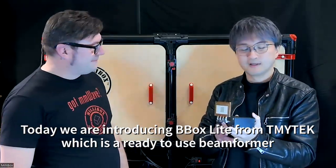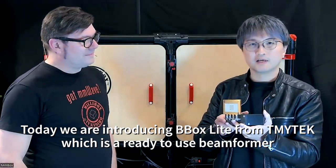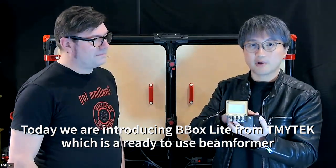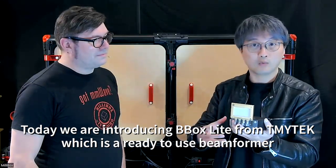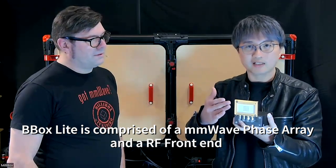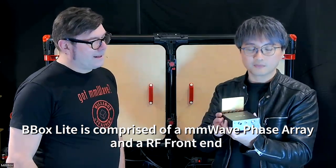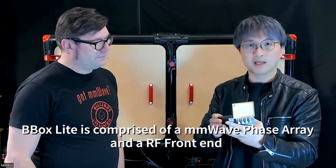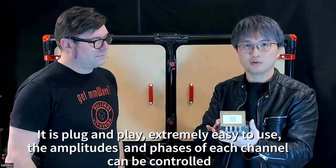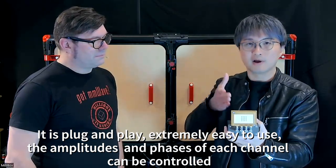Thank you, Jean-Marc. My name is Ethan Ling, co-founder and VP of TMYTEK. Today, it's my pleasure to introduce our BBox Lite. BBox Lite is a ready-to-use beamformer. The whole set works like a phased array. You not only have array antenna, you also have the full RF front end in the box. The device is extremely easy to use, plug and play. Then you are able to control the phase and amplitude of each channel and even control the beam direction.